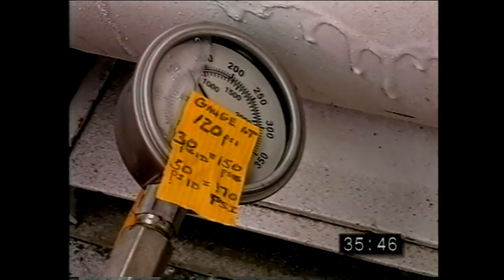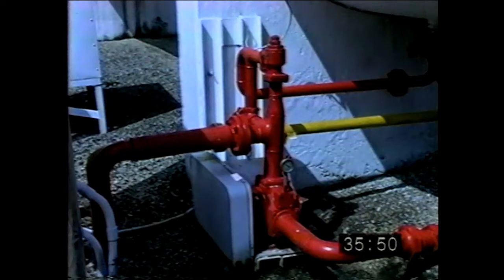The pressure gauge is used to adjust the pressure activated bypass. The bypass and piping must be designed and sized to take the full flow from the pump back into the storage tank at an acceptable pressure differential.